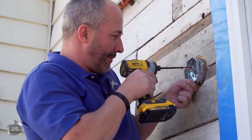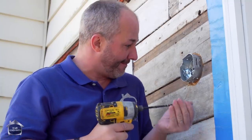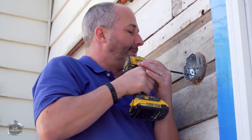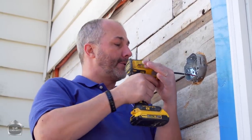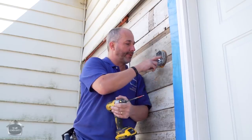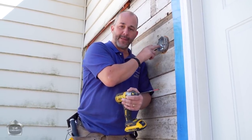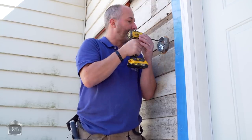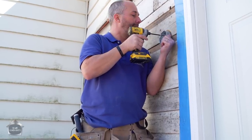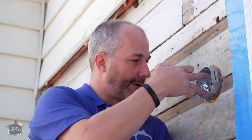We're going to use three mounting screws here — whenever I've got a chance to tighten something on with a little overkill, I'll take it. Try to level that off — beautiful, we're golden. You can use these little screws that hold the wire — there's a little clamp system built into the box, and that screw comes out the back. You can use that screw as a leveling system — loosen it, tighten it, adjust the depth of the box, and help square it all off. So when installing your fixture, if it seems a little twisted, come back over here and use those two screws like a depth setter to twist it. It's a really handy tip.